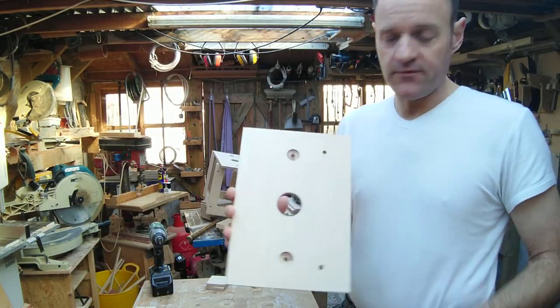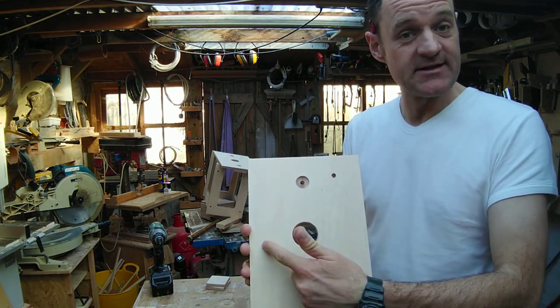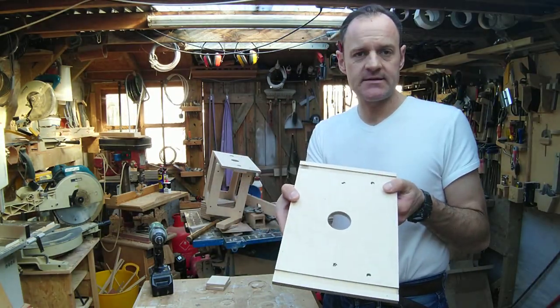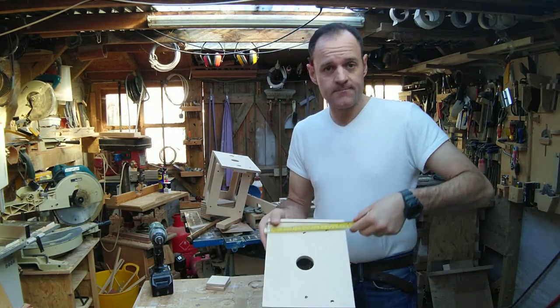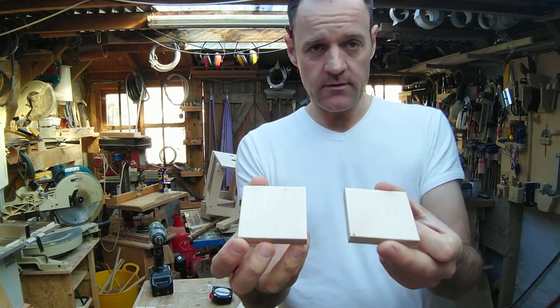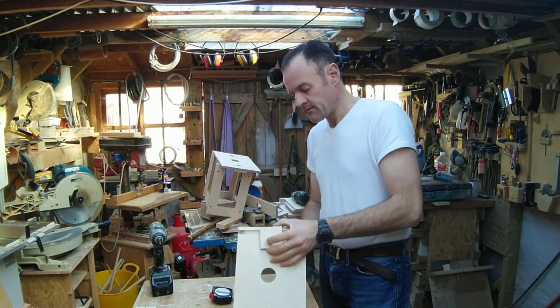The top itself has a front and a back. The back is this point here, the front is obviously this point here. If I flip it over you can see it's rebated. What we need to do from here is mark off on the underside 65mm from the front — these blocks are to support the coach bolt that goes through.